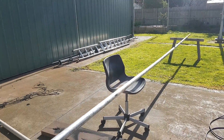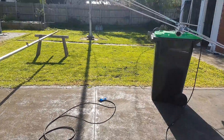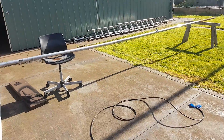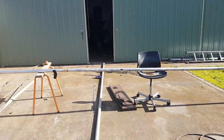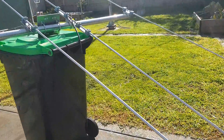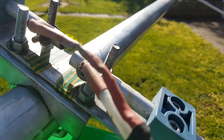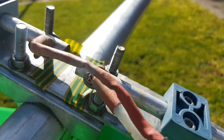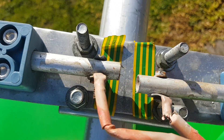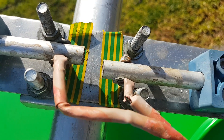I'm excited about this antenna. It should have about 12.4 dBi, making it approximately 10 dBd, which will make it a bit of a monster. Wish me luck! It'll be fed directly — very similar to this one. We feed the coax directly in; it's a 50 ohm feed. This previous one was a 50 ohm feed, even though elements weren't properly aligned, but this next one will be exactly lined up.